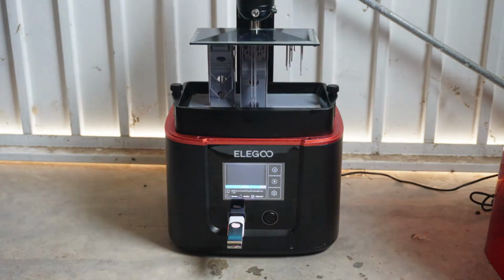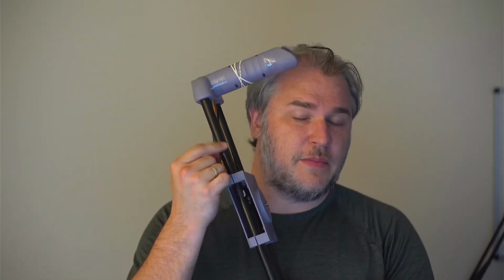Really frustrating, but it did give me that flexibility of designing and modifying the existing designs to get exactly what I wanted out of the design, right? So through that whole process, I printed that Thingiverse thing, made a lot of extensive modifications. Some of the modifications I did was literally changing the diameter of the holes that mount the rails. I didn't have 15mm rails that are standard for film. I had 16mm, which was leftovers from I think it was like a clothes rack or something like that. So I was kind of just modifying the existing Thingiverse thing to fit with 16mm rails.